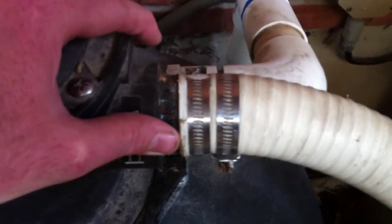From the pump we go up into the sand filter — looks to be about 20 to 22 inches, maybe about 250 pounds of sand. It's a fairly small pool so that's decent. The spa flex — the flexible PVC — has been clamped in place, which is not what it's made for. It's made for priming and glue applications, like we see on the back side here.